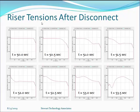This slide shows the riser tension distributions after disconnect in the first few seconds. Just before disconnect at 50 seconds, then at 50.5 seconds the tension in the lower section has changed. At 51 seconds the tension wave has travelled up to mid-riser. At 51.5 seconds it has virtually reached the top. By 52 and 52.5 seconds we are affecting the top. At 53.5 seconds there is a big change, as at 53 seconds we switch on the recoil shut-in valves and change from tensioner springs to constant-length tensioners.